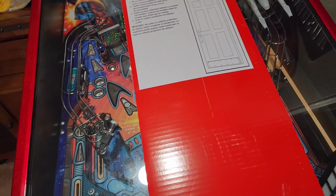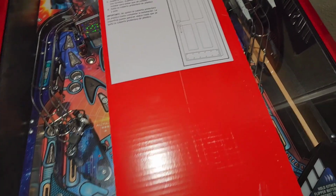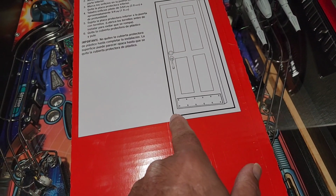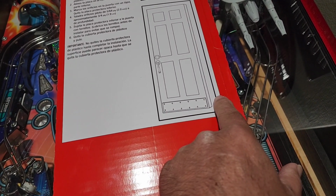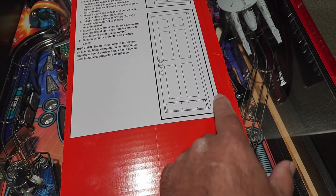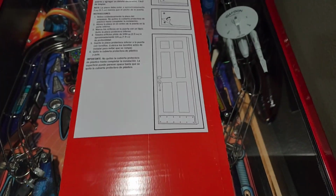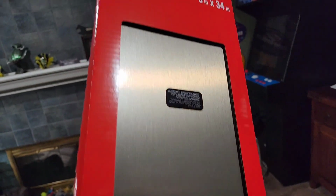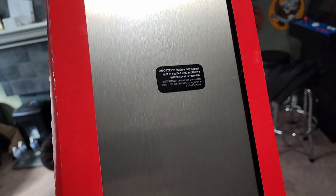Slide it down, start all the way over to the left because there's about 2 inches. This is 34 inches. The stove is 30 inches. So if I go 2 inches all the way over to where the countertop is, that little pony wall, bring it all the way to the edge, and then it'll hit about 2 inches on the other side. Almost perfect. And no cutting, and it goes 8 inches high. And now when we bring the stove into it, you'll have this nice, let me get it off, I don't want to scratch the paint on this thing, so I'm the only one that puts stuff here. But look at that. That'll go right behind the stove. Just put it right there. It's got like a protective film on it right now.